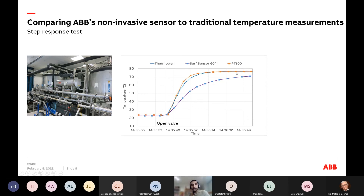The orange curve is that PT100 glued onto the surface — probably the most accurate measurement of the wall temperature of the pipe. Look at its response: that pipe responds faster than the thermal well in this case. For almost any metal pipe, you will see this kind of response, because the physics model predicts that if you have a turbulent liquid-like medium in a metal pipe, there is no difference between your medium and your surface. This is showing you exactly that physics.